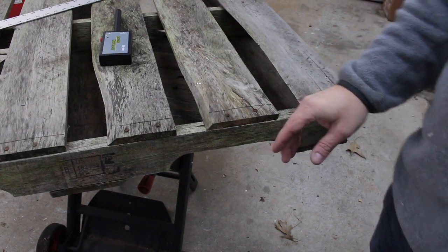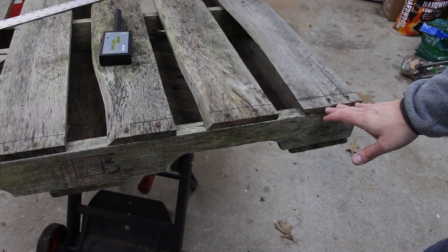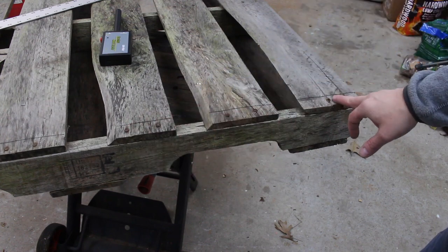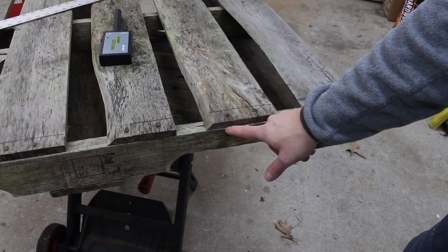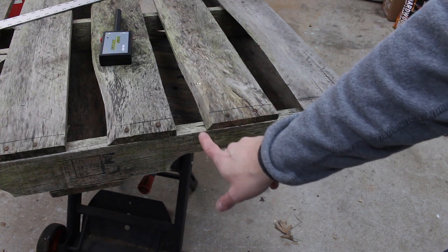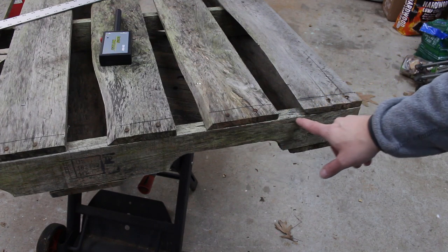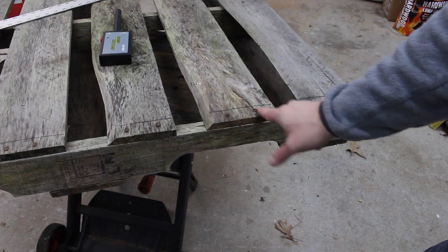There are a few ways you can take these pallets apart. A lot of times when you just try to pry the ends apart, you're going to end up splitting the ends. A lot of people like to preserve these ends because they like the nail holes. So there's one way we can do that — we can pry the ends up just a little bit to get a blade in, and use a saw called a sawzall. We'll take the blade with the sawzall and come between this gap and simply cut these nails using the right kind of blade, and that way you can disconnect these boards from the pallet and preserve those nail holes.